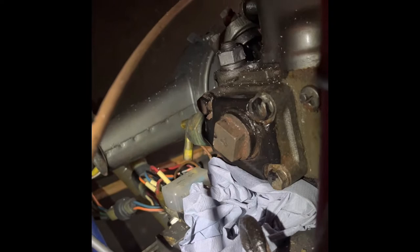Here we are on the back of the engine — the Yanmar 2QM15. I'm trying to do this now. That is my rear zinc. It is not coming off in any way, shape, or form, so I've sprayed it with release oil. The engine's still in bits and pieces — kit form — so if I have to put the thermostat back in, that's a job for another day because I haven't got the thermostat yet. Let's have a go at this rear zinc.